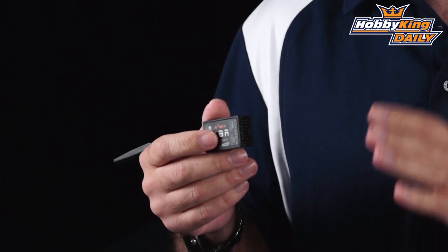This receiver is also backwards compatible with all the D-Series modules, so if you've got those you can still use this receiver with the D-Series. You lose the 16-channel S-Bus option, so it's restricted to eight channels, but you do still retain the new smart port which uses the hubless sensors, as well as the ability to utilize the older analog sensors with the hub if you have those.